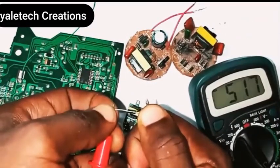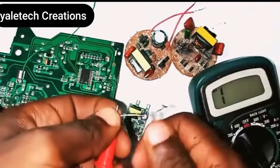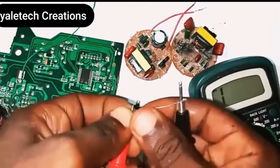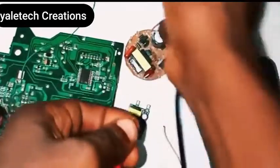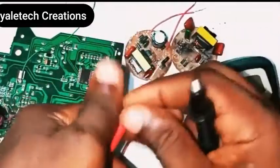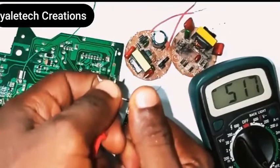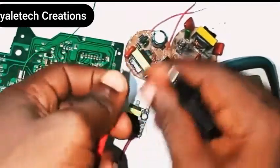This one is reading now — let's turn it the other way around. It's not reading in this direction but if you change it the other way it's reading, so this one is still okay. Now for a single diode that is bad, both sides will read. If you check here it reads, and if you turn it the other way around it still reads — that tells you that diode is bad.